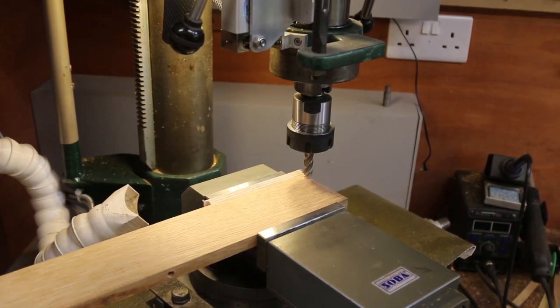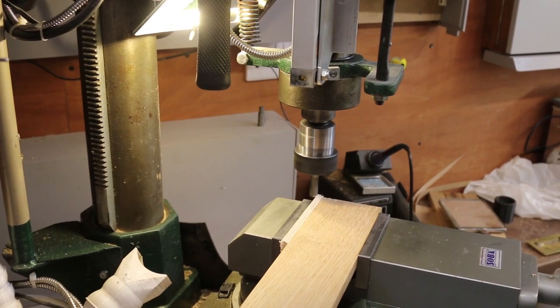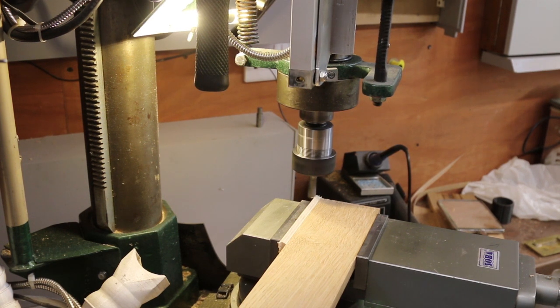Since I was already using the milling machine, I decided to machine the tongues at the size of the front piece using the milling machine. It was already set up, and it's about an order of magnitude more accurate than the router table. Note that I'm using a packing piece, both to protect the workpiece and also to prevent tear out.